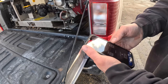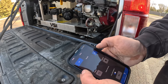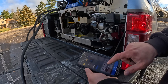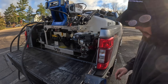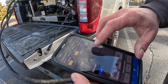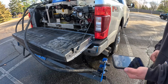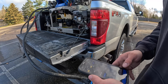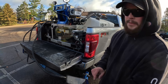I can throttle it up right here, put it back down to an idle. There are lights, the hose reel — I turn on the hose tracking right there, it idles up and sends water pressure to it. Then go right here to auto and you can adjust your gallons per acre. Pre-treatment is around 40 gallons per acre and post-treatment is more like 80. Those are pretty easy numbers to remember. Then it's just a matter of clicking these on — and it's not going to actually spray right now because I'm not moving, because it goes with your speed of how fast you're driving.